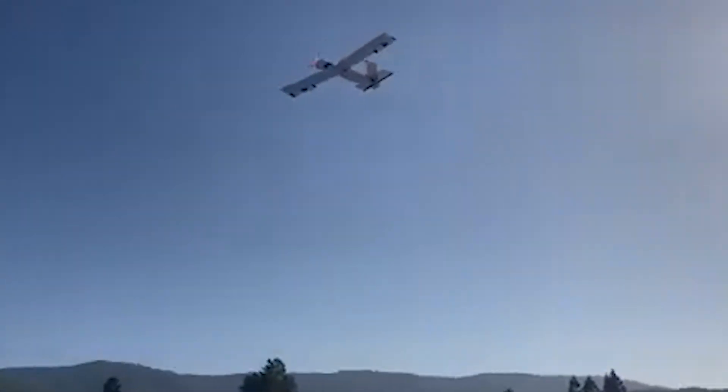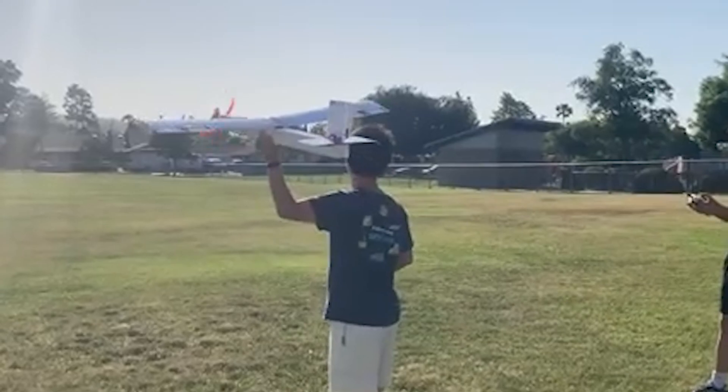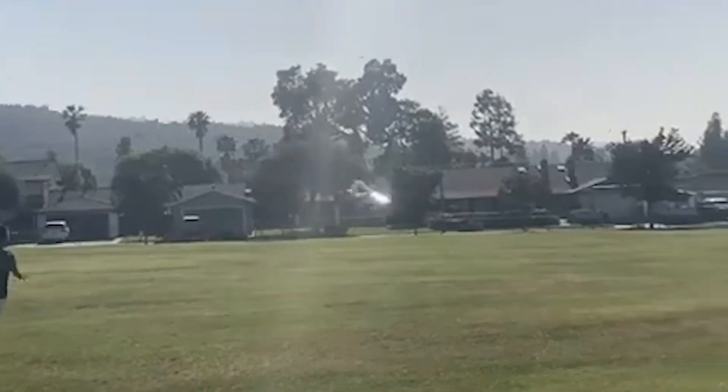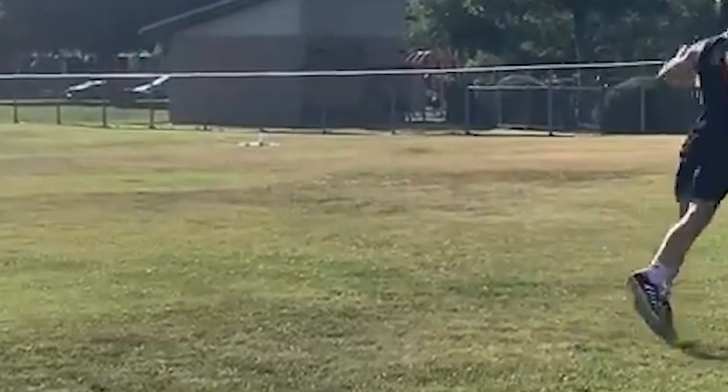After that, I made three other trips to the field to take flight — all of them were unsuccessful. From these failures though, I learned to have a stable and strong motor mount, check polarity as my rudder output was reversed, and check orientation of the flight controller, as on one flight my flight controller was reversed and I did not notice, which led to a plethora of problems with stabilization.